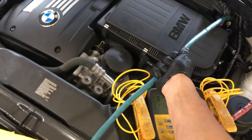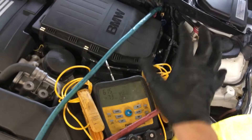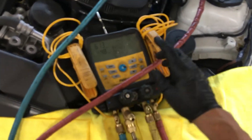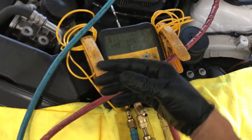Then I'll be drawing all the vacuum out through only the low side hose. So it's performing two actions — I'm doing the pressure decay test and then I'm also using it as a sweep gas to bring it out under the low side only. This also aids in removing moisture that you'll be baking out of the system.